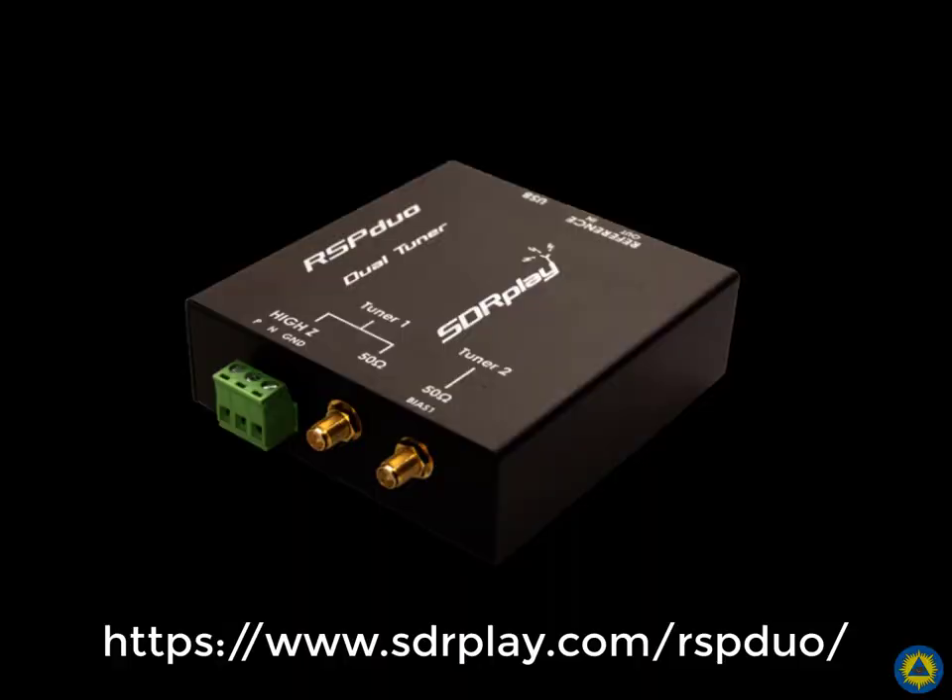So why am I focusing so much on the high impedance input? My first task for this device is to be a field monitor for an antenna measurement party we're having here in a month or two. I'd like to have a consistent and linear sensor out there that measures the E-field, which is why I have the mini whip involved. I'd like to remove that if I can, and having the high impedance option built into the SDR is a great first step. The fewer components you have in the line, the fewer things can go wrong.